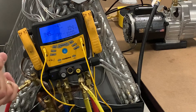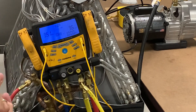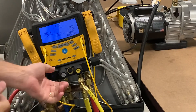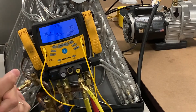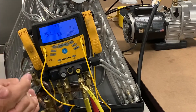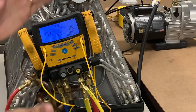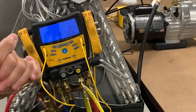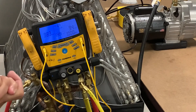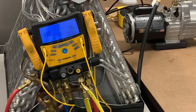Back to the main point of this video: do not shut off your left and right valves. After you've gotten down to your target microns and want to do your 10-minute test, shut off your back end. If you're pulling on both lines, shut off both of those, but leave your left and right open. I can't stress how important this is. It seems like a no-brainer, but 80 to 90% of people I've talked with were actually doing it wrong — they've never really been checking their system. Thought I'd share.